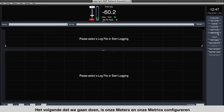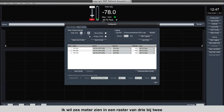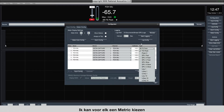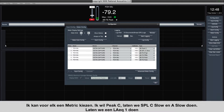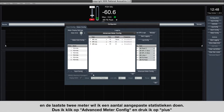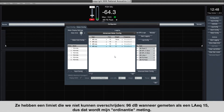Next, we're going to configure our meters and metrics. In the Meter Config dialog, the first setting is how many meters we want to see — I want six meters in a grid of three by two. I can choose a metric for each one: Peak C, SPL C slow, A slow, and an AEQ 1. For the last two meters, I'll click Advanced Meter Config and hit plus. I'm going to do a 15-minute LEQ measurement that's A-weighted — LAEQ15 — because today's venue has an ordinance with a limit of 96 dB LAEQ15. That's going to be my ordinance measurement.